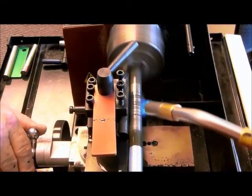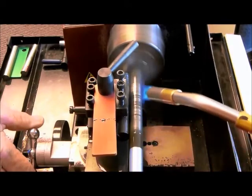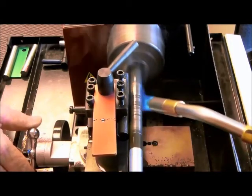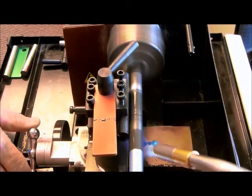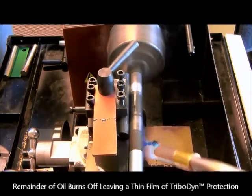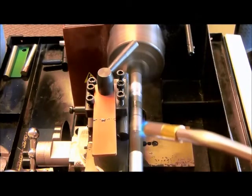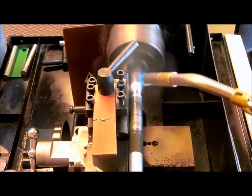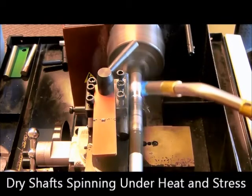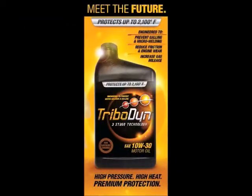At this point the shaft speed has not changed. It continues to spin freely. If you look at where some of the gloss is on the minimal material remaining, you will begin to see it go light gray as all the oil is totally burned out. We are running dry. Look particularly in the center — you will see the last of the material, all liquid, totally gone. The shaft is still spinning. Completely dry shaft. The shaft is now rolling.